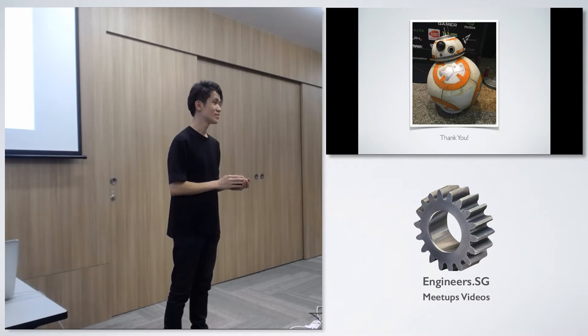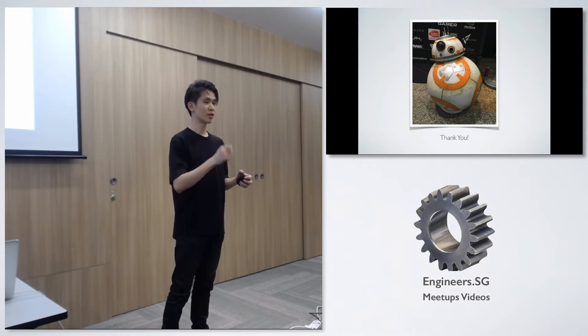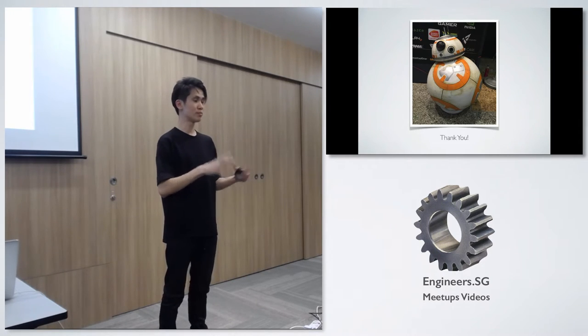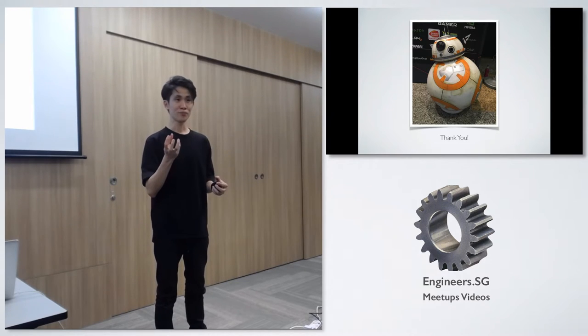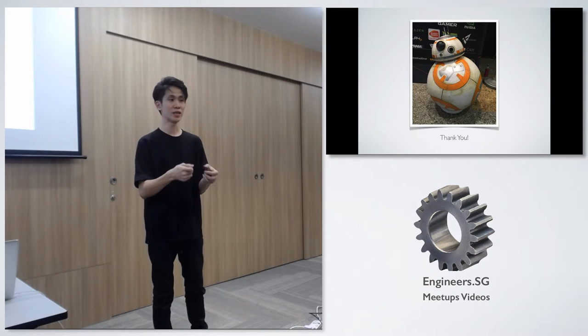So you use a special glue for the project, it's supposed to stick together in PLA, right? Oh, yes. The one I'm using, I print mainly in ABS because it's hard and I want it to roll around. But the concoction works in PLA. The concoction is actually super glue gel, like a gel form, not a liquid form, and then you mix with talcum powder, or some people mix with flour. Then you mix together and it creates like a creamy, toothpaste-like thing. And then when you put it over the joint and put it together, it hardens very fast because it's super glue. And then it becomes very hard because the super glue actually bites into the plastic and holds it in place. And then when the super glue hardens, it becomes plastic.